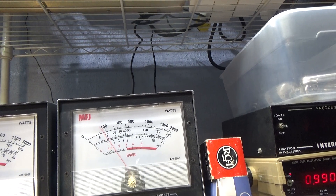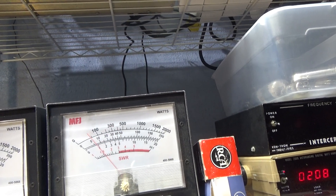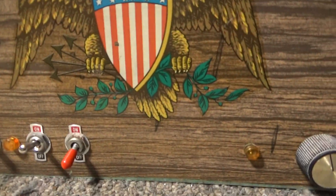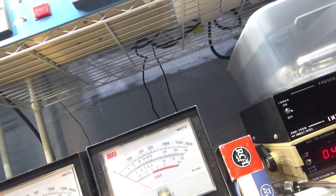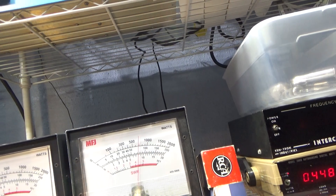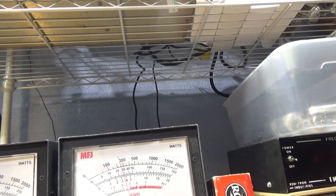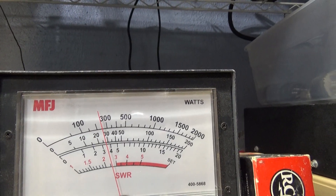From two watts swinging to 150 on audio — talking about 50 watts, blowing about 80 watts. A lot of swing out of this little modulator! And lastly putting it on peak — talking a little over 250 peak watts audio.